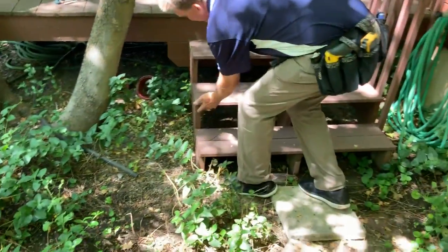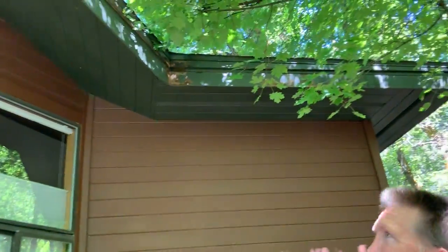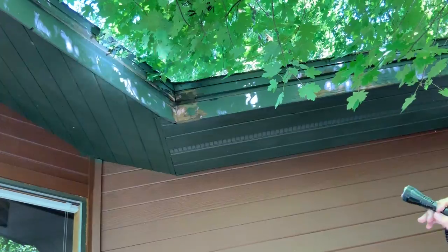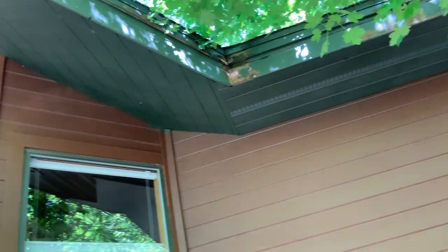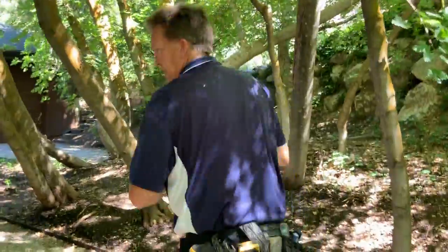Notice the stairs — if you look closely you'll see the splitting on the stringers. Old, and preserving the trees was the highest priority as you look all the way up around here. There are no gutters — see how there's no gutters? This corner area — they paid somebody to take care of all the painting and the trim but they didn't do that back here. This is where we start to get into snow, icicles, and all of that. Because it's wood trim versus aluminum or vinyl capping, I'd recommend aluminum on all that soffit work — turn it into a maintenance-free situation.